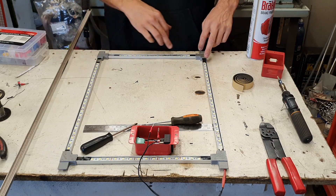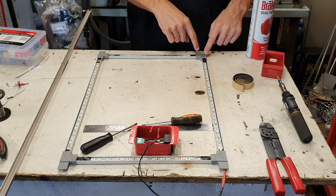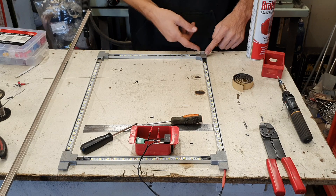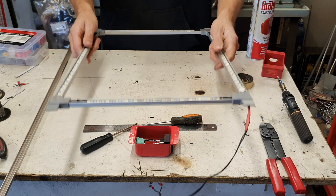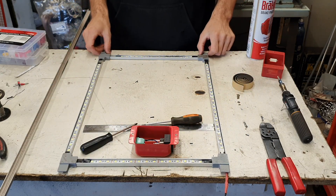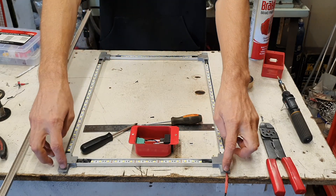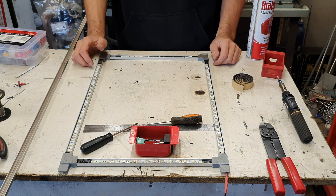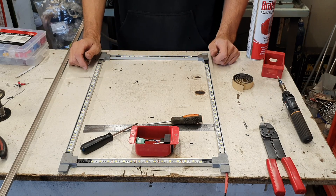The wiring is quite easy. In the design of these 3D printed joiners there's a large enough cavity on the inside to feed the wires through without much trouble, which makes it really simple and quite a strong solution. To attach the frame to the cabinet it fits in place well as-is, and I use double-sided tape on the tabs that stick out onto the sides. As long as you cut your extrusion lengths correctly the side locking tabs should still work properly.